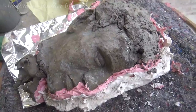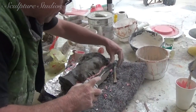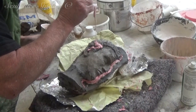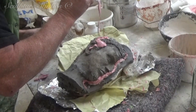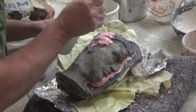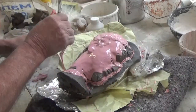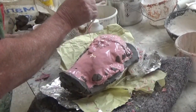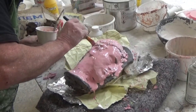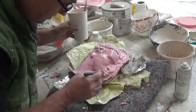Once the first half is made and the model is flipped, some release agents are added to help prevent the rubber from sticking to the model and the other side of the mould. When both halves are complete, this will be separated and the model removed from the inside. Unfortunately a clay master pattern is unlikely to survive at the best of times, let alone when it's crumbling to pieces, but at least we know the shape itself is going to survive from this whole process.